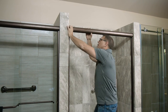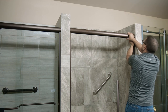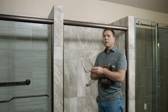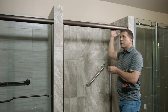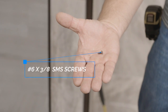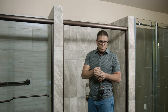Pull it right down on top of your wall jams. Make sure you've got a good seat and it's not sitting twisted in any way. You want to center it into your opening so you've got basically a strong sixteenth reveal on both sides. Now that I have my header in place, I'm going to secure it down. I'm going to drill two holes, one on each side, through my header into my wall jam on the inside. We're going to anchor them with two of your number 6 by 3/8 inch screws. When screwing metal to metal, we always use a number 31 drill bit.